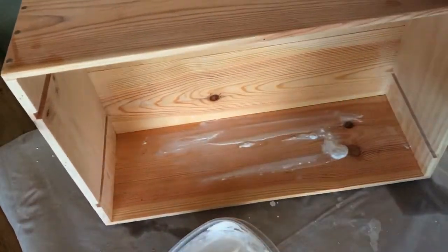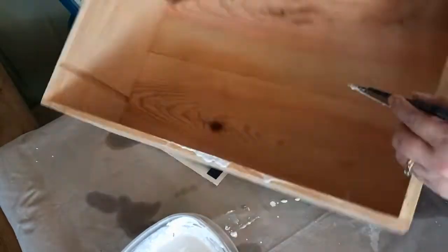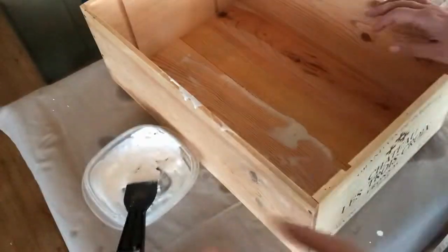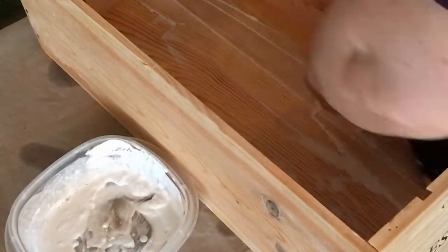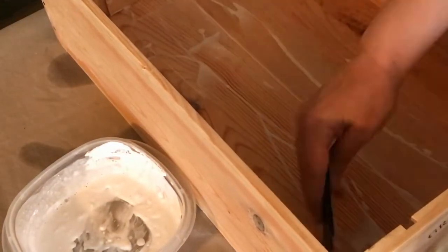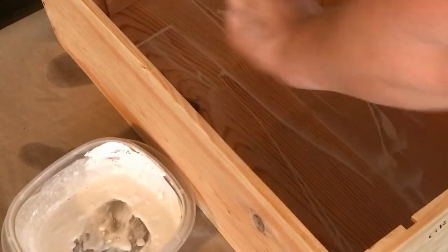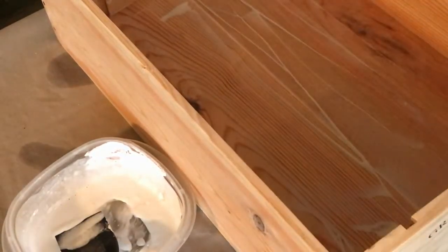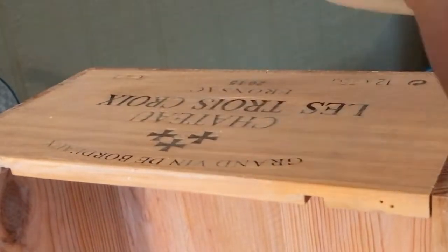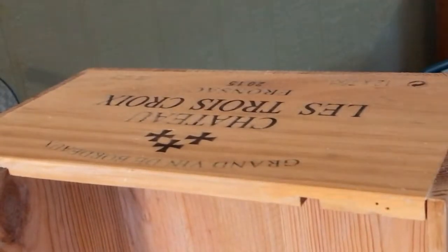In the end, I decided to go with the combo of the two. First I watered it down, and now I'm putting the watered-down stucco on — though I'd recommend pre-mixed grout if you're doing this on something nicer. You slather it on, scrape it off, and leave it to dry. The biggest thing about any of this is drips are not your friend — they dry that way and then you have to re-sand everything. I'm going to finish applying the stucco and come back with the 50-50 chalk paint and water mix. This is a very forgiving technique — if the stucco covered too much, you can just quickly wipe it off.